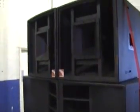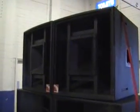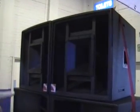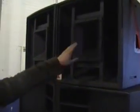This system you're looking at here has got 2 18-inch horns at the bottom, 4 Sinbins in the middle, and then 2 of our long throw MPH10s, which is a 2-inch compression driver and a 400 watt 10-inch. The driver's located right in the centre of the 10, so the sound arrives at the ear at exactly the same time. Oh, nice. Very long throw, used for outdoor events and stuff. Oh, okay.